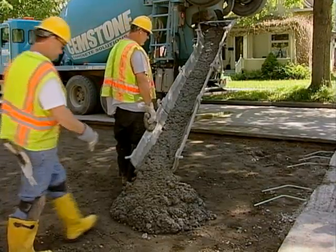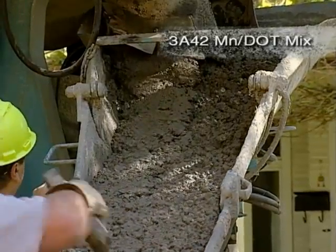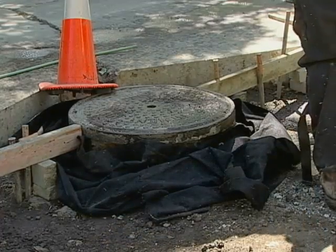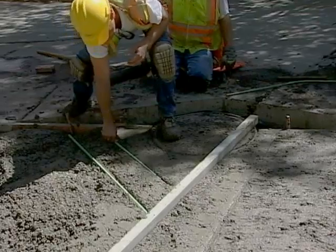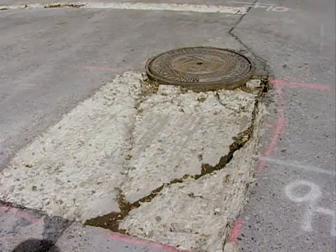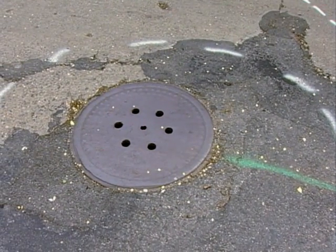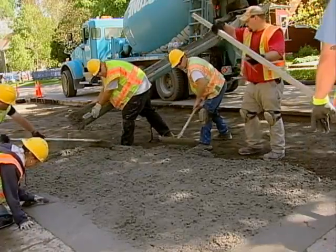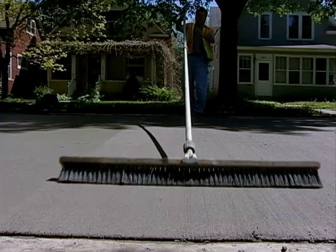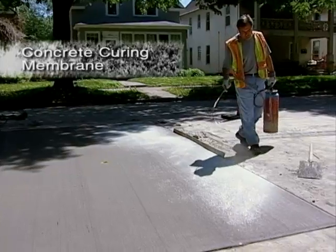When it's time to place the concrete, a typical 3A42 MnDOT mix is sufficient. If there are manholes or drains, add a fabric around the rim before pouring the concrete, and once the concrete is in place, sink in bars to help reinforce the drain area. This is important because manholes and drains are areas where cavities and other erosion often take place. After the bleed water has evaporated, trowel and broom the finished concrete as you would in a normal concrete road paving project, then apply the concrete curing membrane.